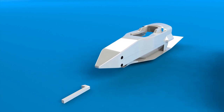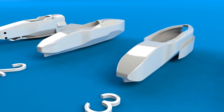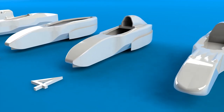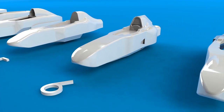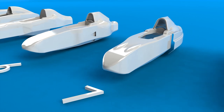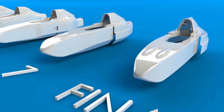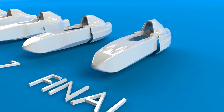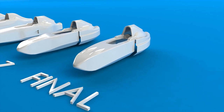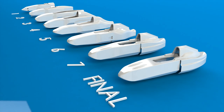The bodywork itself went through many iterations before I came up with the final design. I used SOLIDWORKS a lot as part of my job but I'm not typically drawing smooth, curvaceous shapes like this, so I had to learn by doing in this case. I was also figuring out how I'd build it as I drew it. The limitations of my chosen construction method actually had a large influence on the design itself — I kept the shape as much as possible to simple curves that could be made from bent wood, and I limited the curved shapes to things that could be cut from a block using a straight cutter.